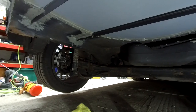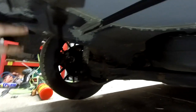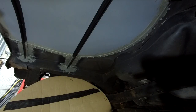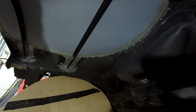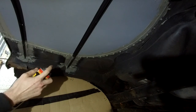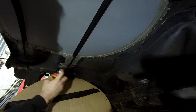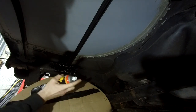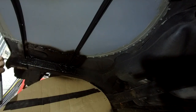As you can see, we now have an unbelievable amount of space under here. So what I'm going to do right now is just underseal basically everything you can see. I've already seam sealed it; that's had a bit of time to dry. So I'm just going to get a load of underseal and make everything under here black and give it a bit of protection. We've got a little bit of cardboard up to stop getting anything on the suspension. So we've got Hammerite body seals, apparently with added wax oil and corrosion inhibitors. Let's just spray a bit and see what happens — well, it's definitely black.